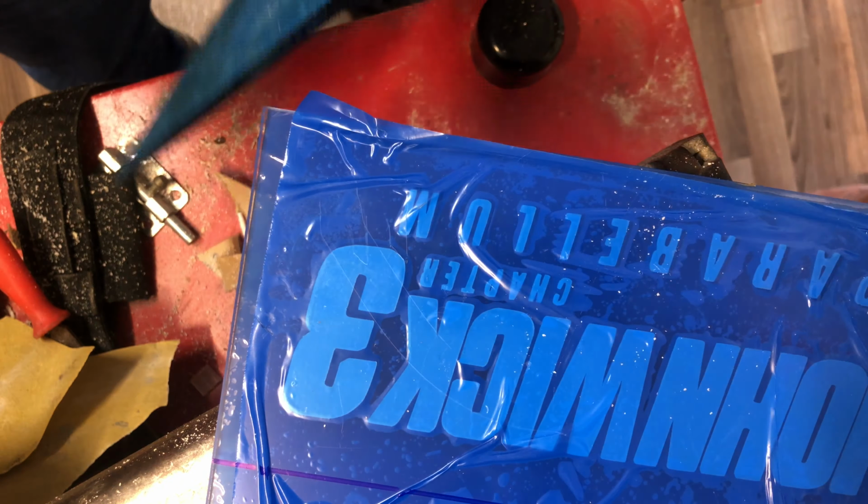I have a little Portaband that is on a swag table. So I have a little foot pedal that I can switch this on and have both of my hands free to guide the parts through, cutting exactly where I want. I'm also being very careful to cut out the Sharpie marker, so I'm going right along the edge of the Sharpie marker, so there's no real correction that I have to do with filing.